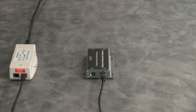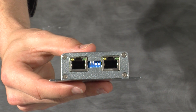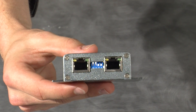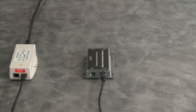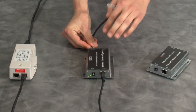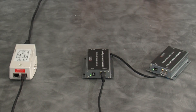Starting with the same setup as before, we will now enable PoE to pass through on LAN 1 by changing dip switch 3 and 4 to the down position. The same can be done for LAN 2 by changing 1 and 2 to the down position. Keep in mind all four switches are set by default with PoE disabled or in the up position, thus preventing non-PoE devices from being burned out. Now that we have enabled PoE on LAN 1, we can connect another 400 foot length of Cat5e or better cable to the LAN in port on the second 828.